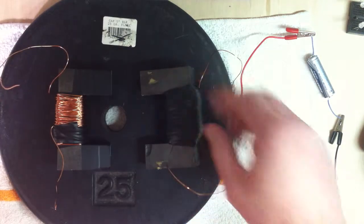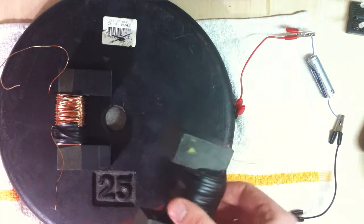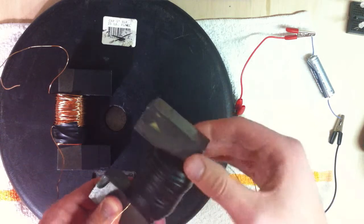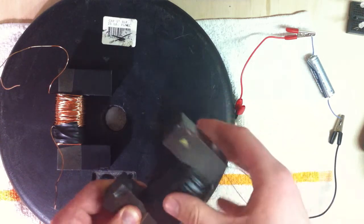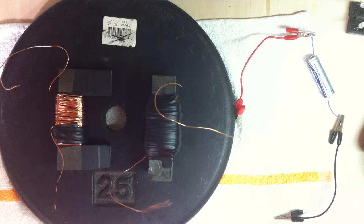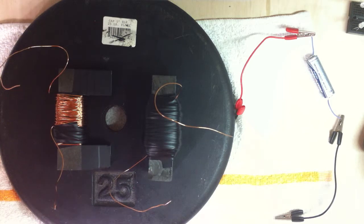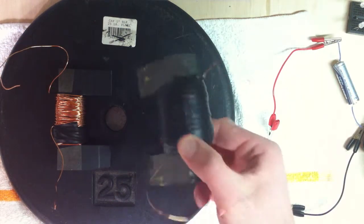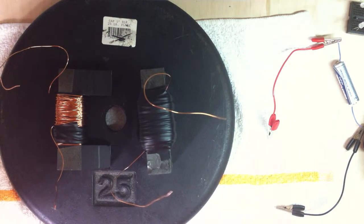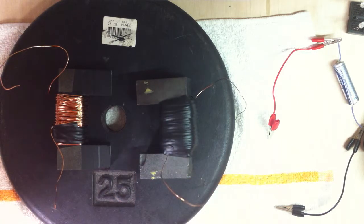The reason is that these pieces of metal don't have high enough magnetic permeability. And that's just a word for what I was talking about before, how a piece of metal can only hold a certain amount of magnetic field within it before the excess magnetic field is just off in space. So what I need to be able to lift this is either a bigger chunk of something like that, but what would be much better would be a piece of metal with significantly higher magnetic permeability.